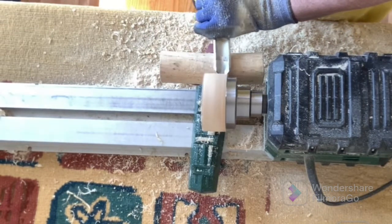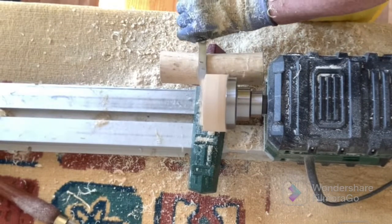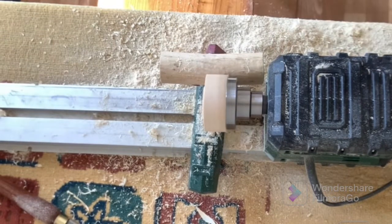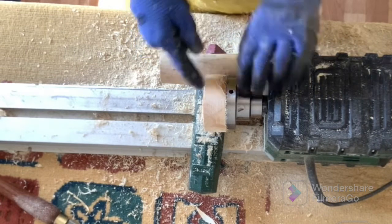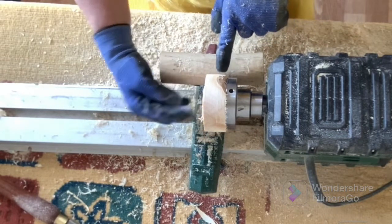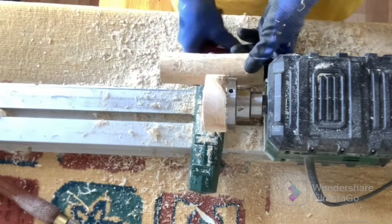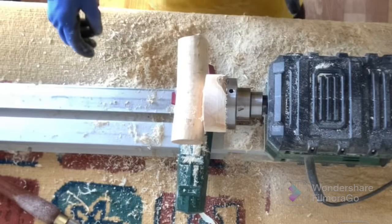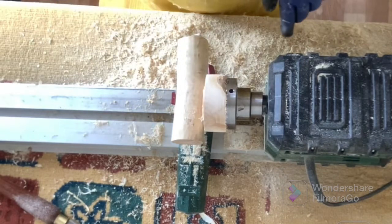Using the roughing gouge again, just to true up that edge since I've turned my block of wood around, and the skew chisel to flatten the bottom, well, the bottom edge. Now this time, I've only skewed part of the way in. I'm happy to leave this centre nub sticking out because I'm about to carve it all out as though I were carving a bowl. Bowl carving. I need to move you. Put you at the other end.